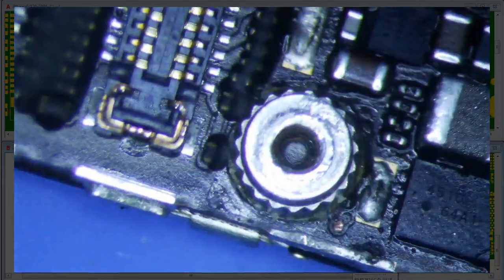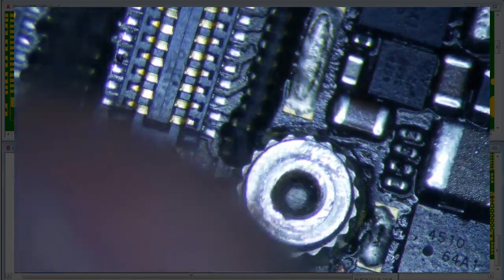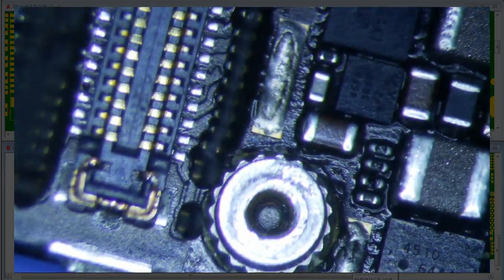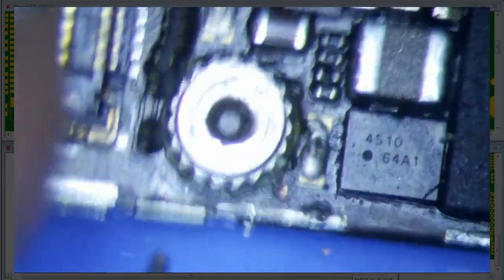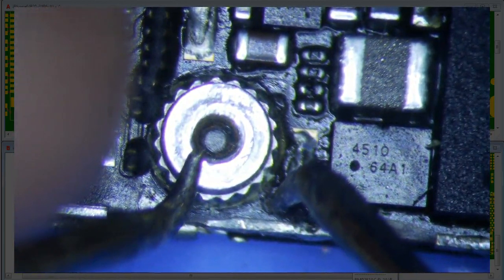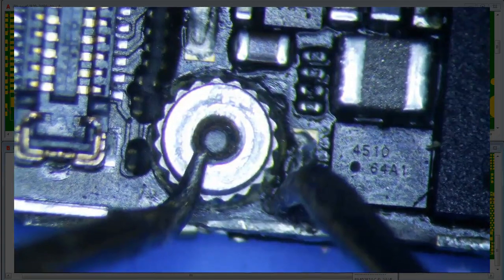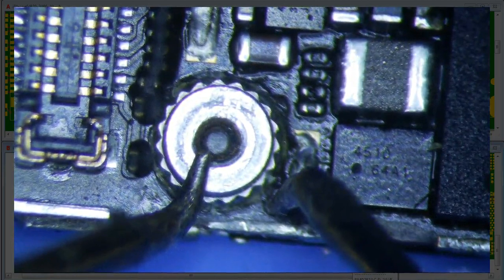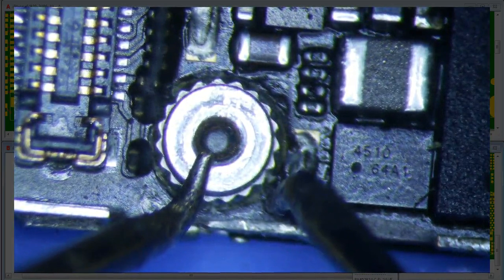My question is: why am I getting 0.57 in diode mode when I don't push down on this thing? When I do push down, I'll measure it right here. Now I'm getting 0.52 to 0.545 — that's not right, it should be 0.46. Now I push down on this little nut and I get 0.463, which means that dot is disconnecting somehow.